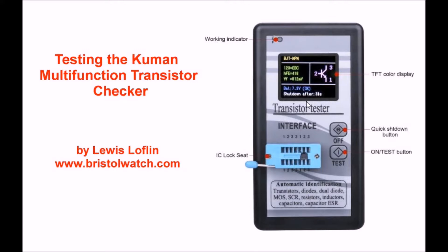But there are a few problems with it that I will be covering. These revolve around it not reliably testing LEDs — it tests a few but some it won't do as well as the MK168. There's a glitch between the switches: if you power it on to test, the screen lights up but it doesn't do anything. You have to switch it off and immediately back on, and then it works. And then there's a big headache with this zero insertion force socket. It also doesn't have any plugs to check larger components such as TO3 transistors.